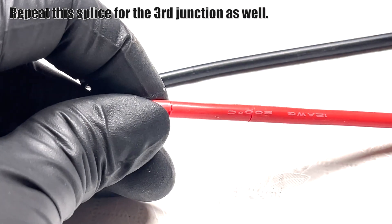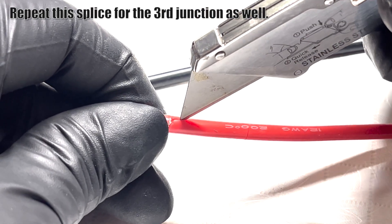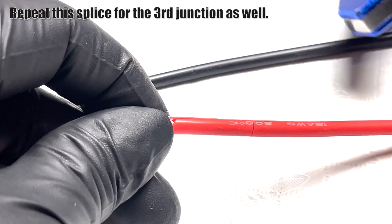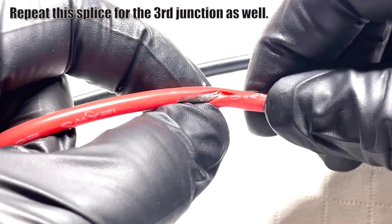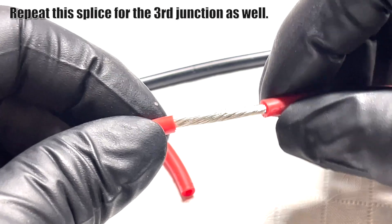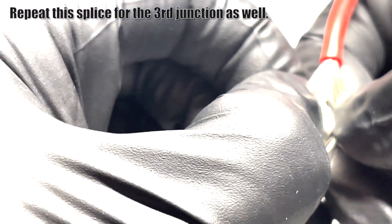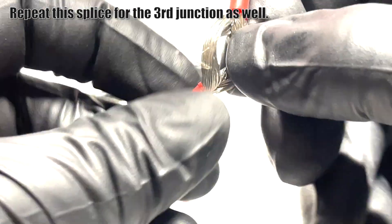Be very careful as you slice down the middle. It's really soft — you might lose a couple of little strands of micro wire there, but don't worry about that. So there it is — this is our exposed wire. Now what we're going to do is split it right in the middle and separate it into two equal strands, create an opening because that's where the new wire is going to go into.